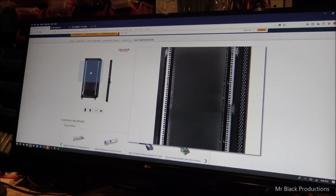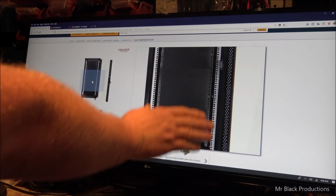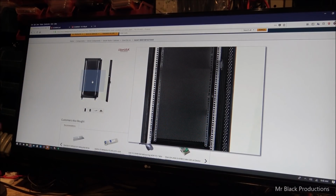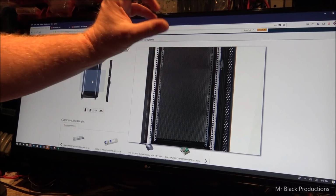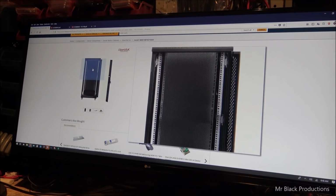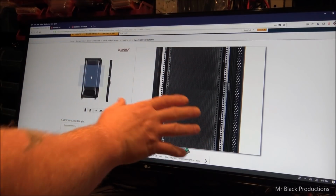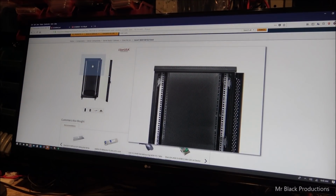And then isolated, well, then we'll probably actually use plexiglass, a plexiglass plate that'll have all the meters on it behind the door, and then above that we'll have access to the amp deck, which is going to be in its own separate isolated RF shielded enclosure. And that means all the high voltage will be on the back side in a shielded cabinet, and then we'll have the amp deck on the top.